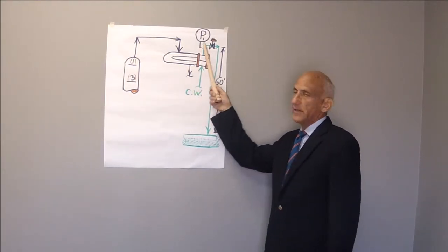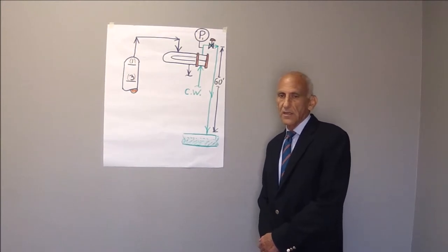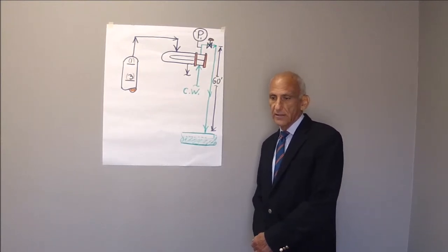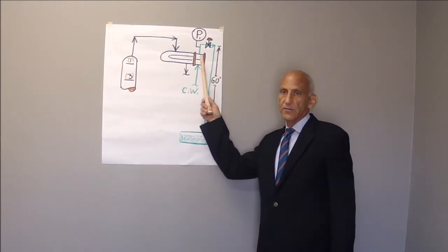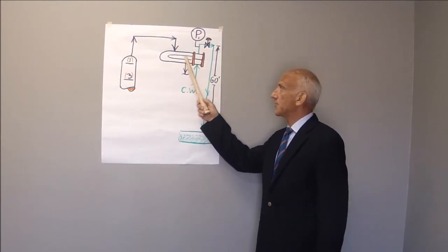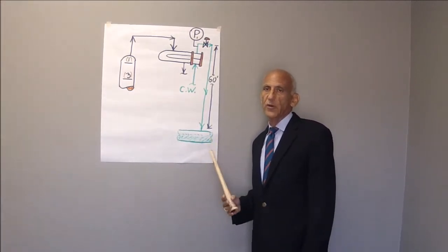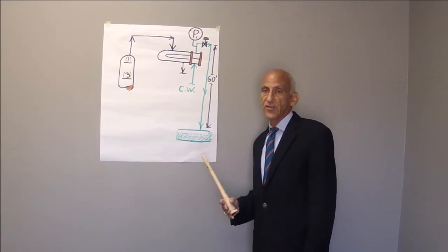And if the pressure at P1 falls well below atmospheric pressure, then the air that's dissolved in the cooling water, especially if it's seawater, will flash out of solution. As the air flashes out of solution, the volumetric flow through the tubes and the exchangers increases, which increases the pressure drop of the cooling water flowing through the tubes, and that has a tendency to choke off the flow.